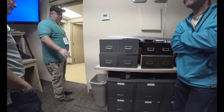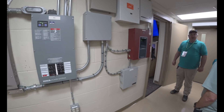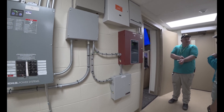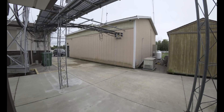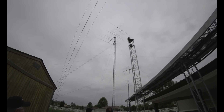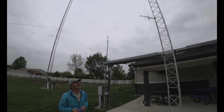The 3905 Century Club — yeah, that sounds familiar. This is where the bureau is, and we go above 24 on the bands here. It's a pretty good-sized LP. I've got a 17 kilowatt generator as a whole-house unit. This is where 40 through 20 are, and that 200-watt setup — and yes, it does have 40. That antenna down there is optimized for 160 meters; we can use it on 40 and 80 but it's optimized for 160.